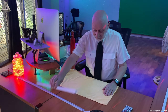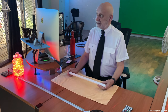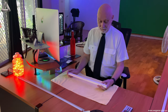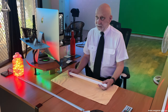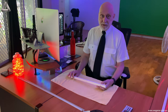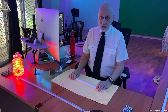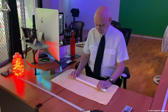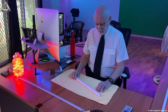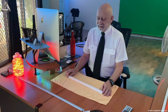I bought these little pieces of timber — 18 by 18 millimeter square — and glued them all around underneath the ceiling. I needed something to get away from the wall, because I was convinced putting the LED strips straight on the wall would create a big problem feeding power in, and I was very right. I used what they call liquid nails. It was quite a bit of work because the walls aren't very straight, so I had to clamp them — not easy, but we got there.